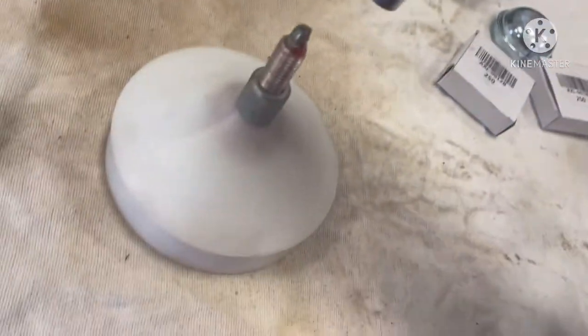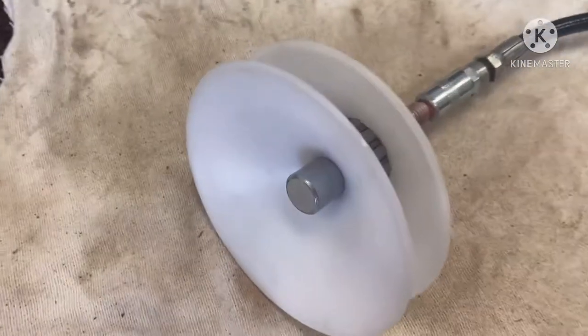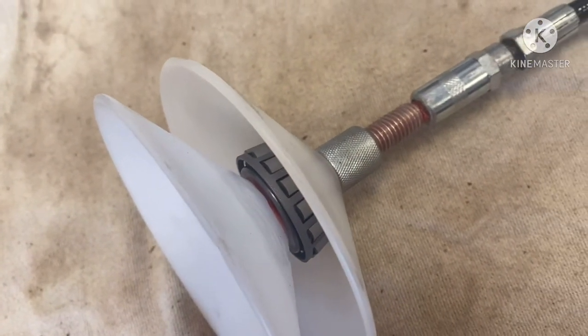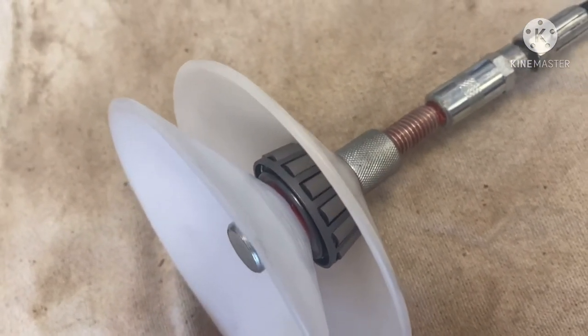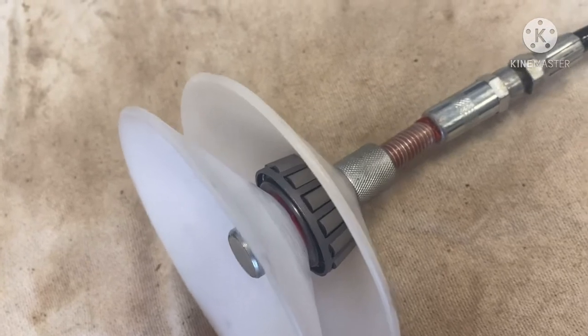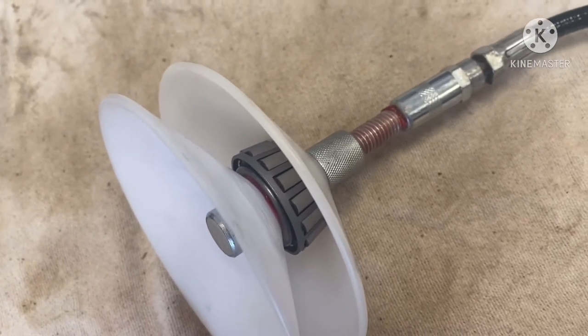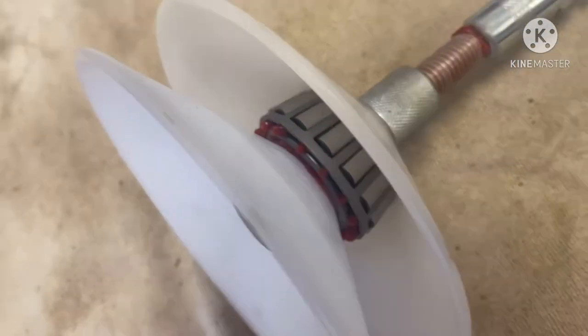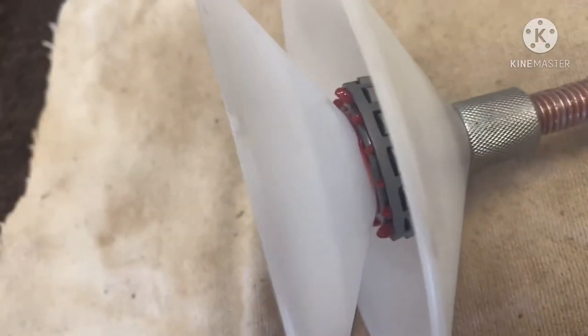Put your grease fitting on top of there. I'm going to turn this sideways so you can see what happens — it's a pistol grip. Look in there and what we want to see: one pump, two pumps, three pumps. When we start seeing it come out, that's when we want to stop. Four, five, six — there we go, you see how it squirts out there. That's exactly what you want; you don't need any more than that. We don't want to over-grease it because then we've got a mess everywhere.